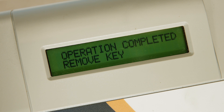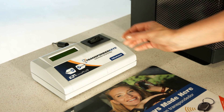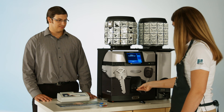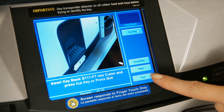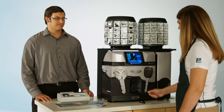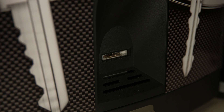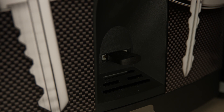When complete, you will be prompted to remove the new cloned key. The EasyClone will ask if you want to make any other copies — answer appropriately per the customer's wishes. Fully insert the new key into the P-Core laser cutter. Press the Cut Key button and then wait for the cutting to stop. Remove the key from the cutter and deburr in the brush slot as shown.